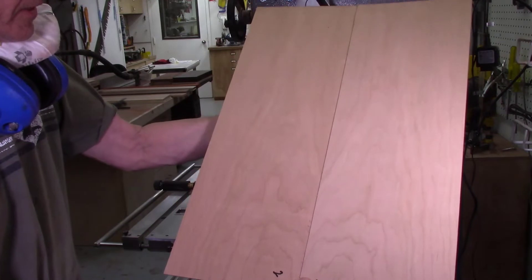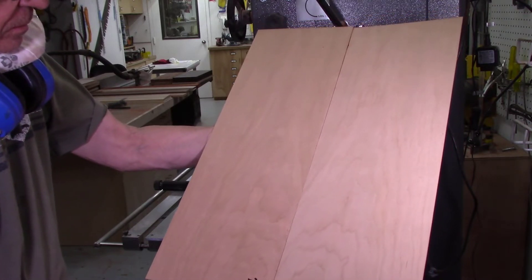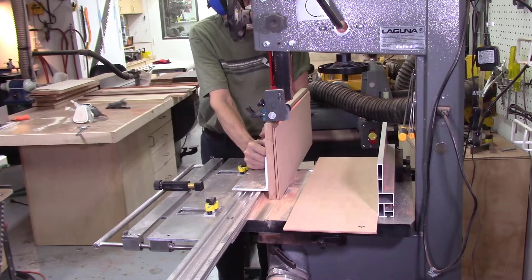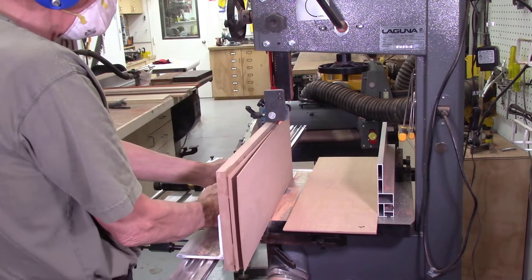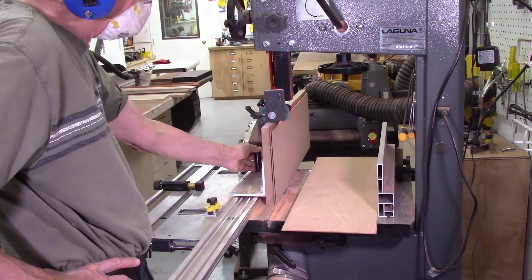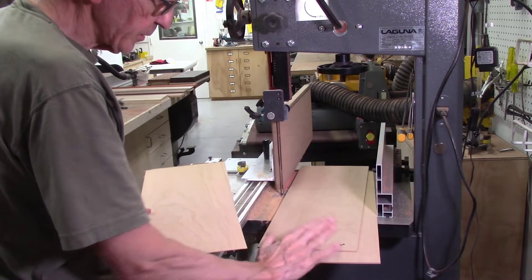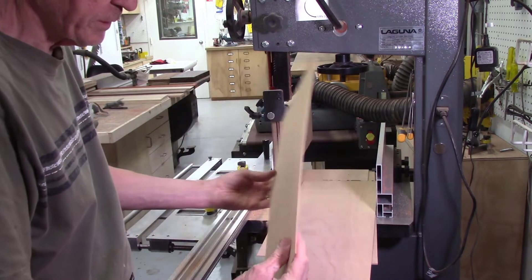These are very good cherry panels with a pretty nice smooth surface. They measure about 123 thousandths, so I'll get my two guitar back pieces. Since I did not have enough wood left to slice another set of guitar backs, I sliced two additional thinner panels: the first was 100 thousandths of an inch thick and the second was 50 thousandths of an inch thick. These thinner panels will be used for other projects in my shop, such as my dizzy bowl projects.